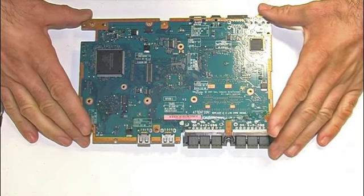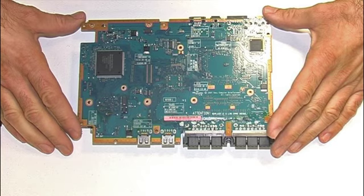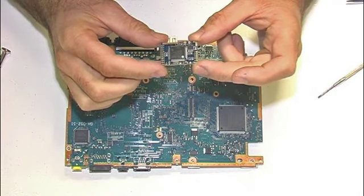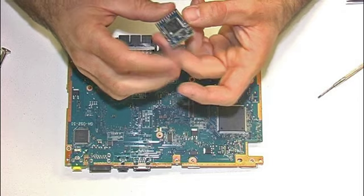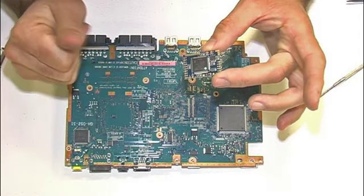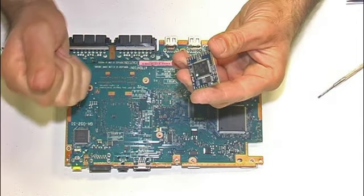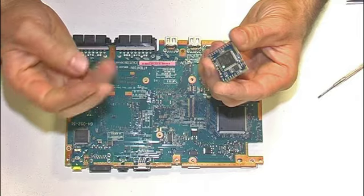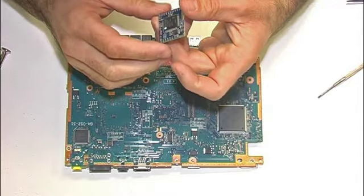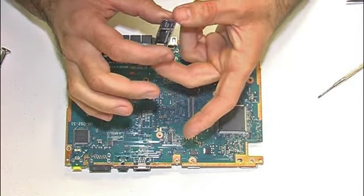Here I have the motherboard. Now I'll check which of the two diagrams corresponds to my PS2 sub-version. The Matrix Infinity ModChip is this one. Now we must handle it carefully — static electricity can damage it. Therefore, we should hold it by the corners. Never touch it with your fingers as static electricity could ruin it. Handle it with care, always holding it by the corners, and touch the metal contacts as little as possible.